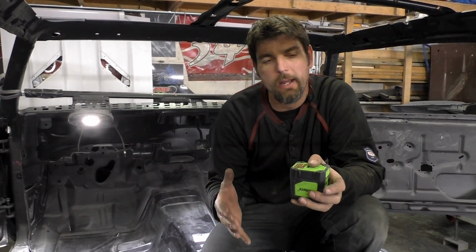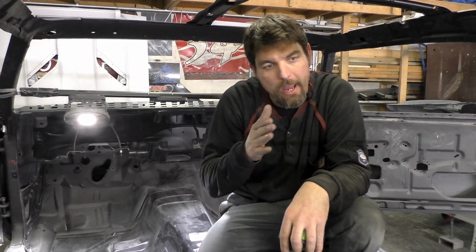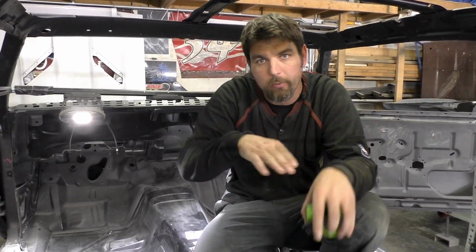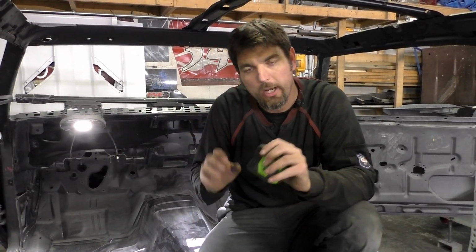So the idea right now is to make sure the 4-link isn't twisting or binding and everything's straight, so your car's not dog walking, where the rear's not following the front going down the road crooked. I know you've seen a car where that's happened. So we're going to do our best to prevent that and do some checks to make sure the suspension works as it's designed. Again, there are some design differences from car to car, so go ahead and check these points.